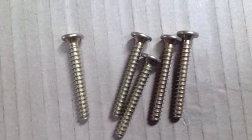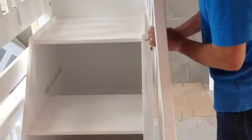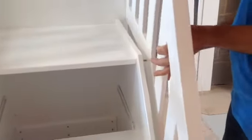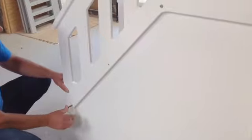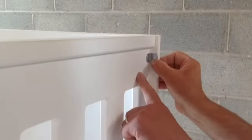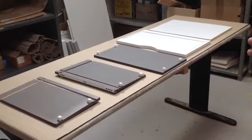Now I'm going to fit the handrail. Start by putting one of the bolts into that hole, just line it up with the hole that's already there. It doesn't matter that you're not holding the handrail in the exact position — just get the screws started. Repeat on all four screws until the handrail is fixed. There's an L bracket that fits at the top of the handrail — you'll need two bolts, two nuts, and the L bracket, and just fix it in the pre-marked position.